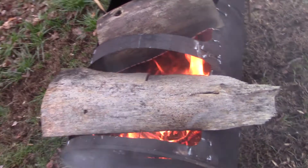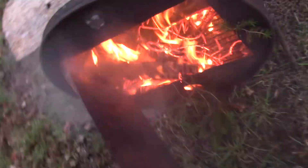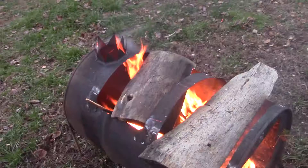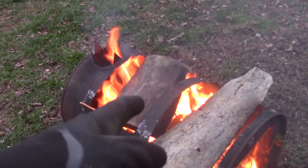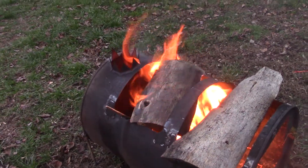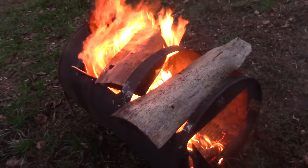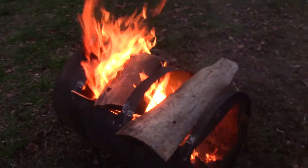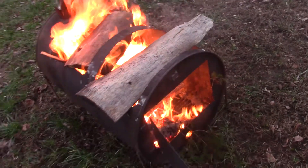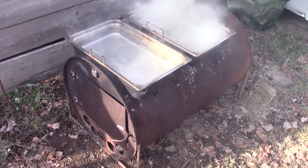There's just that one air hole and whatever gaps are in the door, so just enough air comes through — it's kind of a lazy flame. Watch what happens when I open the door and let it get a full draft. Now we've got flame along the whole length and flames coming right up to the back of the barrel. So right off the bat, before I even do a test boil, I'm definitely going to need more air holes on the front.